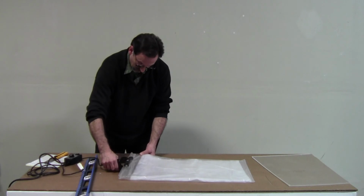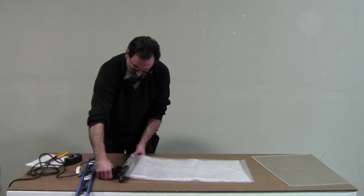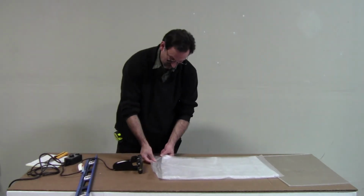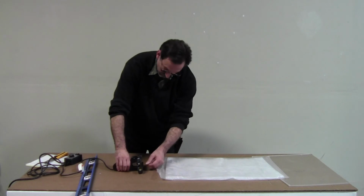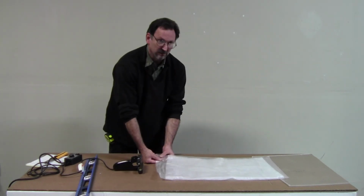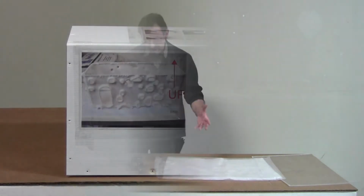and it's just like the other system. You can just come down here, and it's important to get the temperature right. If you get it too hot, it will basically goop right out on you. You'll see it melt. If you don't get it hot enough, it'll look like it's sealing, but then it'll pop. It can pop out later.